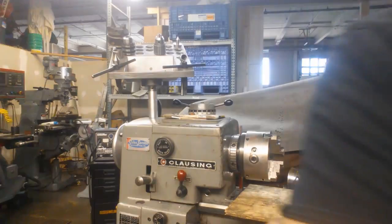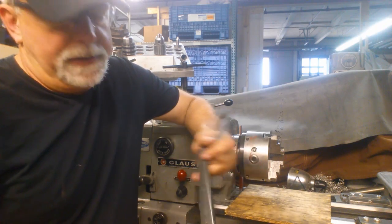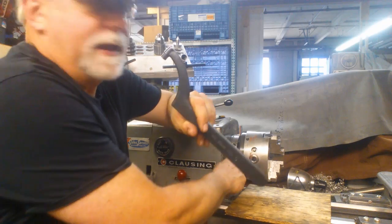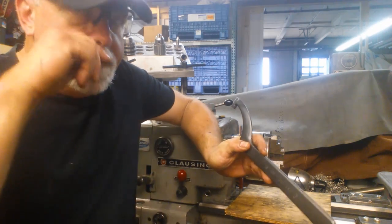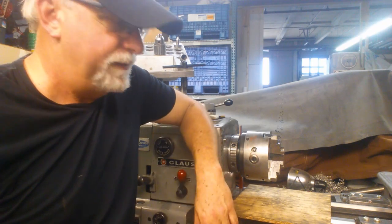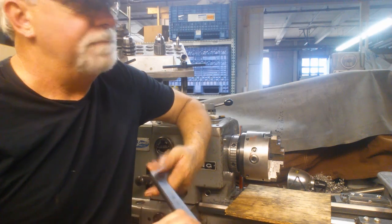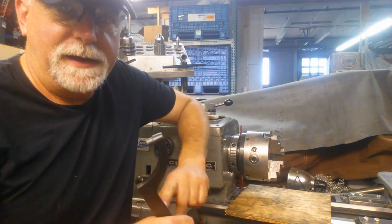Something else about the American spindle taper — you definitely want to have the proper wrench. This is a Martin 466. They're not terribly expensive. It's also called a 5, and I think that has to do with the diameter of the locking collar — it's probably about 5 inches. The pin is 7/16ths — that's this guy. There are others made by Armstrong with a slightly different numbering system, but I like the Martins. They're just really well made; they don't have any bad edges. A lot of the Armstrongs have a kind of groove on both sides. Just a matter of personal preference — I kind of like this one better.